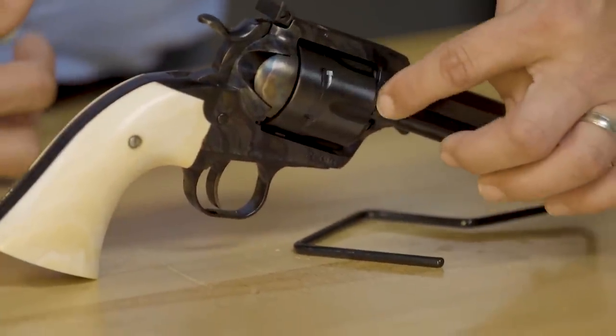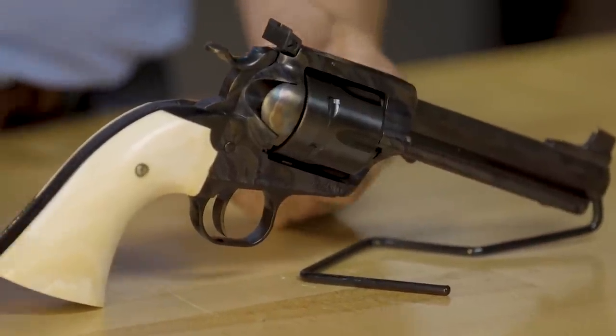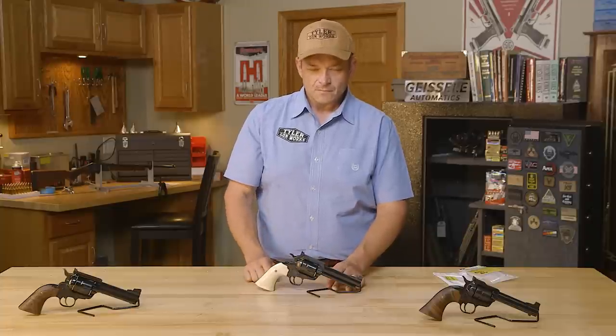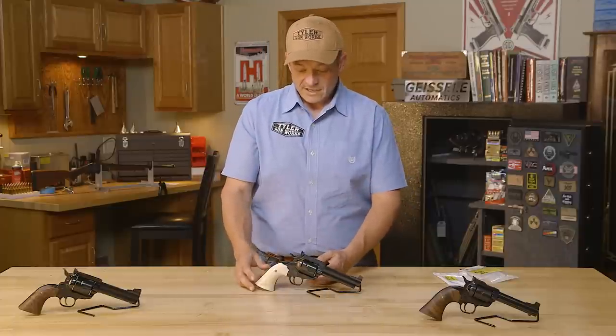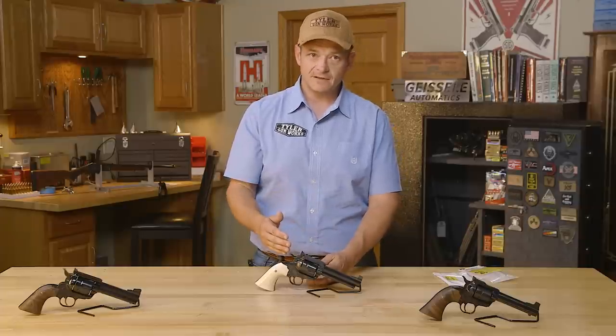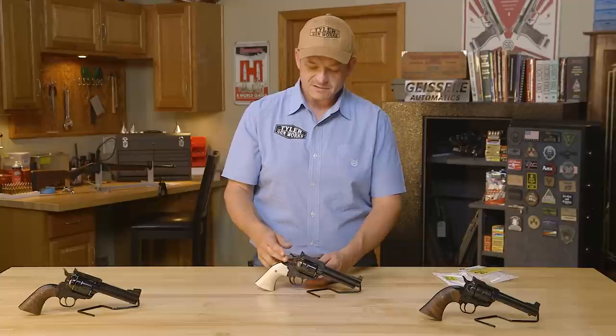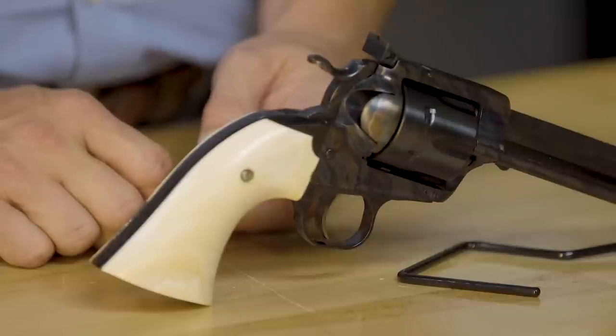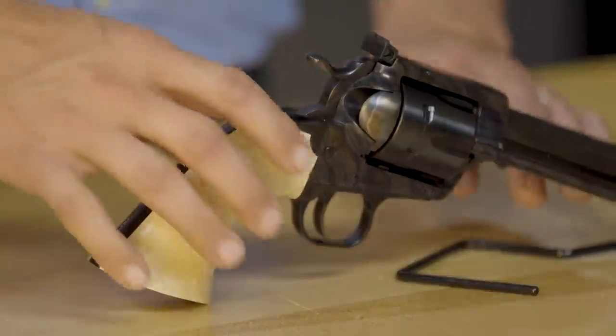End-shake is the distance from the barrel face to the cylinder face, right in this vicinity. You want that to be seven thousandths or less. In one of these custom revolvers we set that gap at about three thousandths. In doing so you've got to maintain it — keep it clean and be mindful, or you could get it to drag. But maximum accuracy is what we were shooting for, so we went through the timing and set it to where it's absolutely perfectly timed, then relocated a few things to get alignment properly.